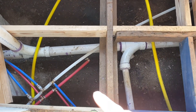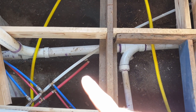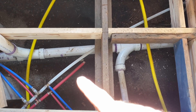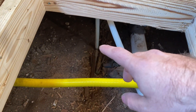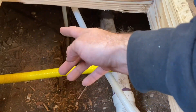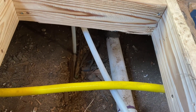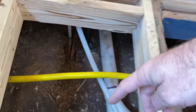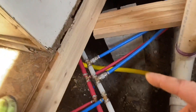If you're here to see how I'm going to tie in a bathtub — hot and cold — then you're in the right place. I dug from the meter all the way to right here. This is just white PEX coming out of the ground; it goes two feet underneath the house and kicks up right there. The cold water comes in the house right there and runs over here to the hot water heater closet.